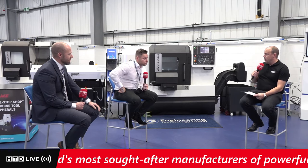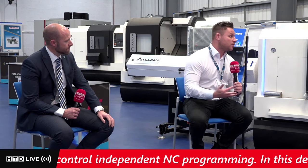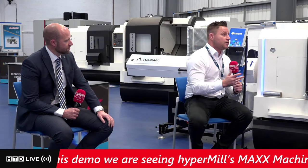First question: if you had a 12-year-old machine running on a Fanuc control, would you still be able to perform this strategy? Yes, you would. It all depends on machine memory — how much memory you have under control. In Hypermill you can adjust your number of line numbers, changing from four to one, so if you add a four in the G1 configuration it will put a line number every four millimetres. You can adjust how many line numbers you'd like in your program. It will take more memory on an older machine but the machining strategy itself won't take longer.